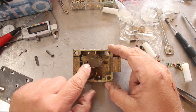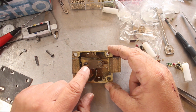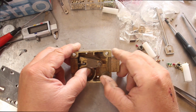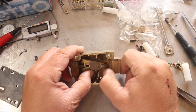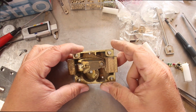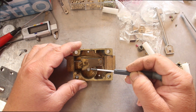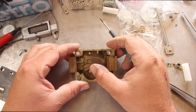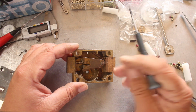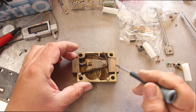What we have is our post here. So these levers, when the key is turned, lift up to a certain height, and this allows the bolt to slide in and out like so. I've just about made the right shape of the key to get this to move. If I push a few more, there we go. So that's the locked position, and when this is in the locked position now, the key has to manipulate these levers up to a particular height, and as you can see on the front here, it's got these little teeth here, so if you were trying to manipulate it, you're going to get stuck on those. Once all of these are at the right height, it will allow the actual bolt, which is here, to slide backwards and forwards.